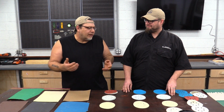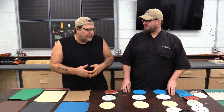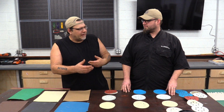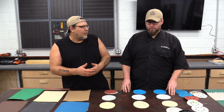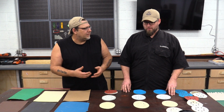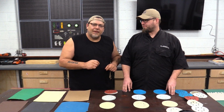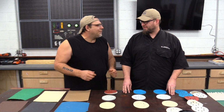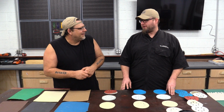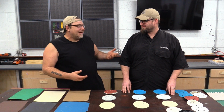And I'm going to put on maybe 2 thin coats of, let's say, a nitrocellulose lacquer, thinned out a little bit. I'm not going a full spray; I'm thinning it out 50%. Where do I stop with the sanding process? Well, the best place to stop is 180 to 220 on bare wood. Listen, where's the best place to stop? 180 to 220 grit. All right, cool. Explain why.